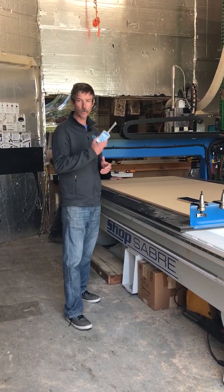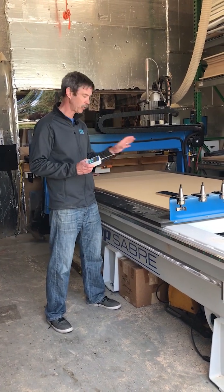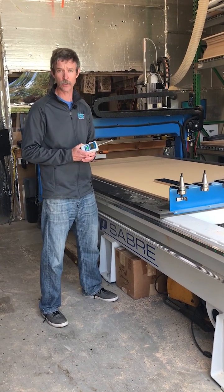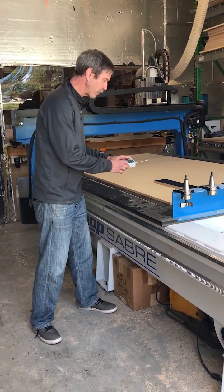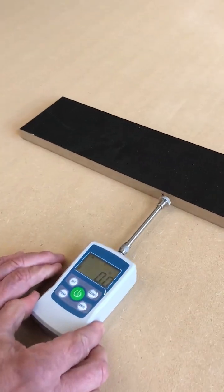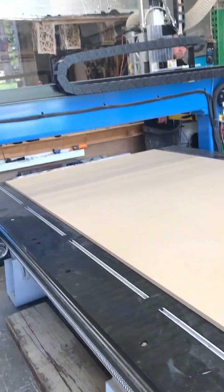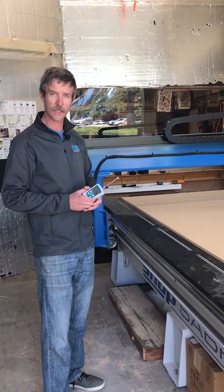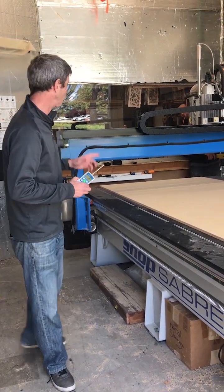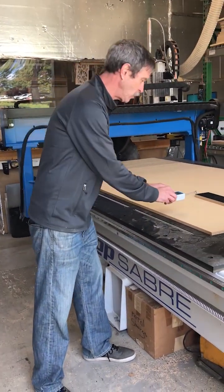So to do some of this testing, we brought our push-pull gauge meter here, and we can tell what kind of pressure it takes to push a part out of place. The problem guys have on their spoil boards is they don't want parts moving. So without the vacuum, we've got our push-pull gauge meter here and there's no pressure. We'll send over to Travis to turn on the vacuum. We're going to leave all four zones open and see if we can get some incremental improvement on vacuum performance. Go ahead and turn that on.